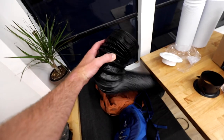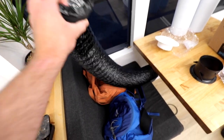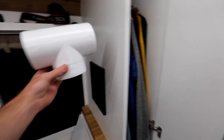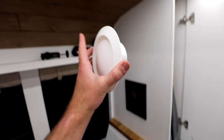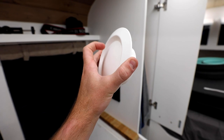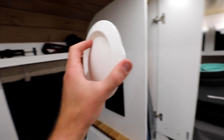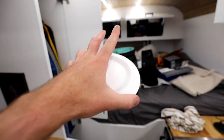I've gotten some auxiliary insulated double-walled air conditioning tubing to carry the cold air from the front of the unit, through the back wall, up the back of my closet where it'll hit a T-fitting. The T will sit just under or just above the shelf level in the back of my closet. On either side of the T, I'll install a vent - one on the dinette side and one on the bed side. The center piece of the vent can be tightened or loosened to open and close airflow, so I can direct cold air to whichever zone I want.